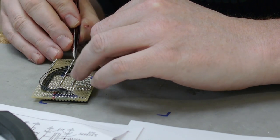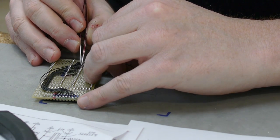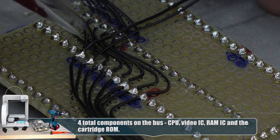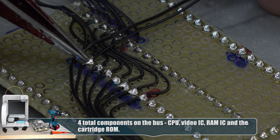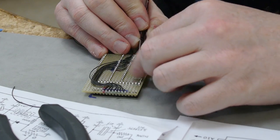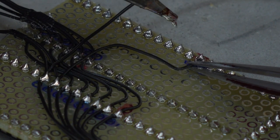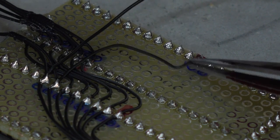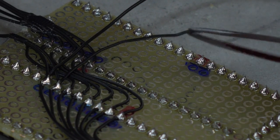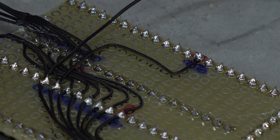Now I'm going to bring these over — I'm just going to go straight over and go between these wires here. Since I've hooked up the bus to this, I don't have to hook anything else up. So this is zero, one, two, three, four, five, six, seven. Now when you're attaching a small wire like this, you should point it down a little bit. That ensures that it is as low as possible and close to the pin in the copper. If you poke it in like that, the thickness of your tweezers doesn't matter. In these situations, I use the X-Acto knife to cut the wire just to make sure it's exactly what I need it to be. The angle cutters might be a little imprecise for this.